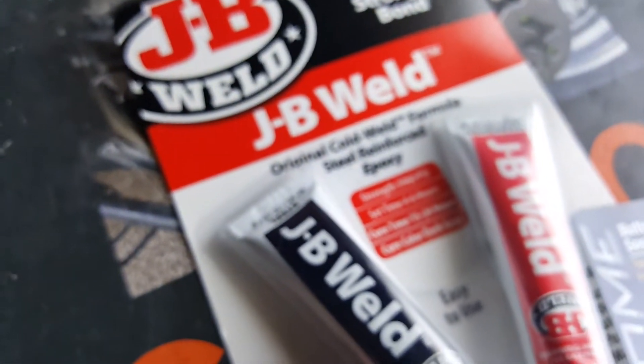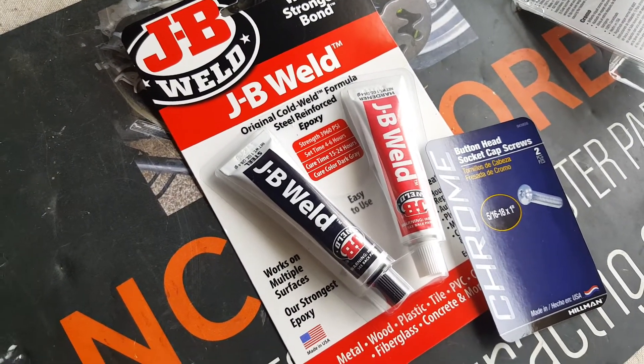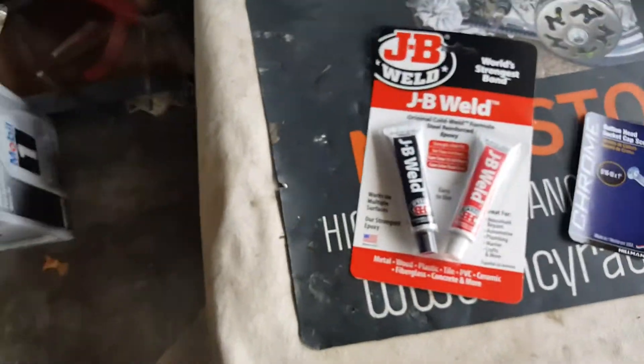We're just needing JB Weld to fill in the gaps. When the JB Weld is hardened — I always use the long cure time one, because that will be the best bond. I can use the four-to-six hour one, but I always leave it over 48 hours anyway. I don't plan to work on it for another 24 hours minimum. So let's get started — let's mix them up. We'll use some empty containers. We'll need a little spoon — we can use this tie strap, thick one here, just cut a piece off.